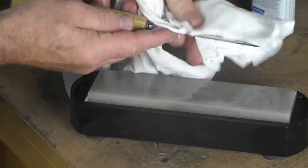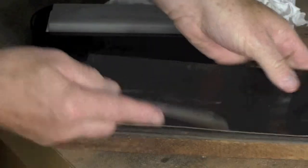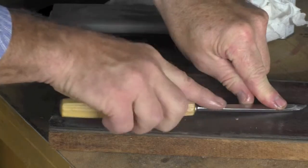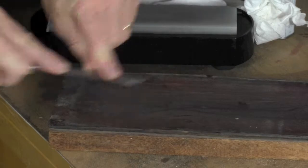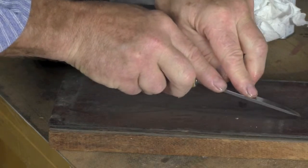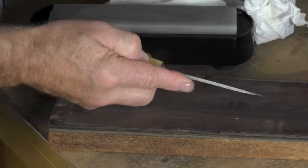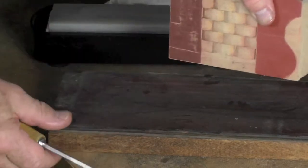I'll sharpen that in the usual way. When I've checked that in wood and made sure it's nice and sharp, I'll strop this here. Again, low angle, covering the whole edge — perhaps from there to the tip, like this. And on the other side, right across that edge. So the whole edge is sharp all the way along to here, so that we can use it exactly as I've shown you.